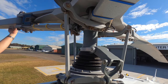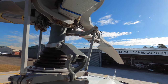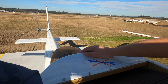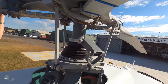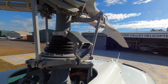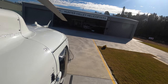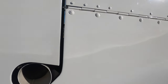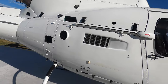It's important to leave the blades in a certain position. We leave one blade out the front so the two back blades are not over the exhaust. If you leave one blade over the exhaust when you start up, you get a lot of heat going onto the blade, which is obviously not very good for it. So we leave the blades off to the side so when we start up we're not having one blade sitting over the hot exhaust.